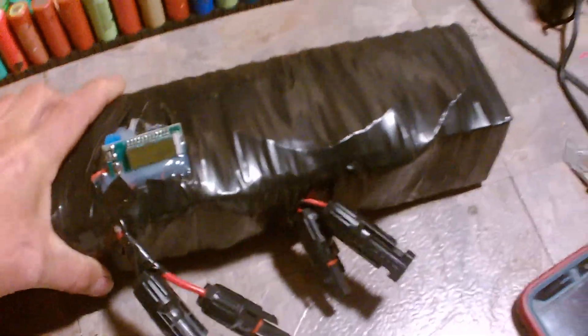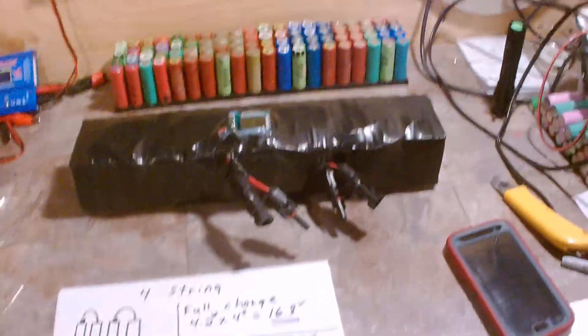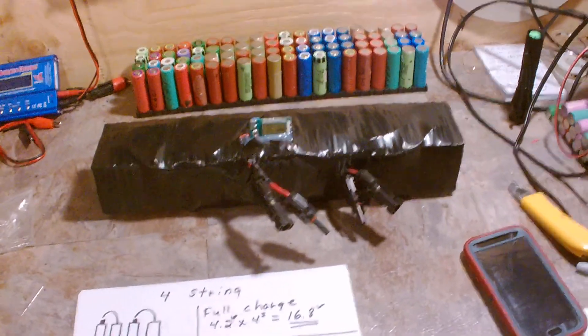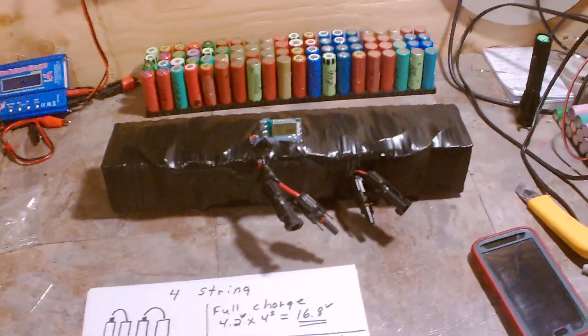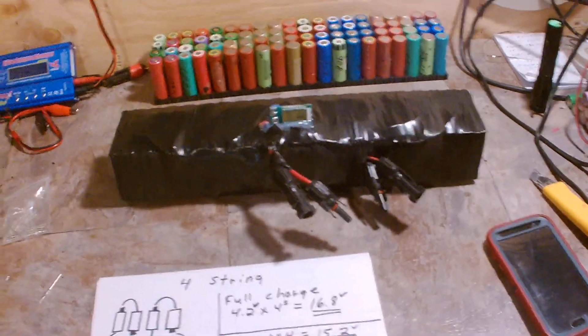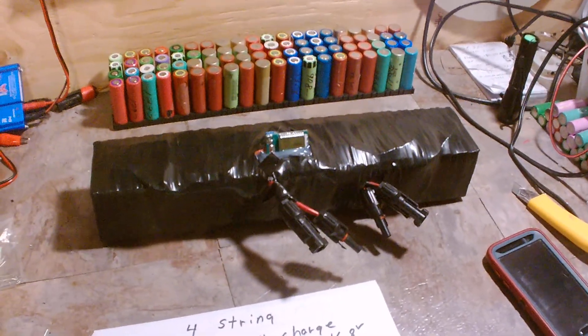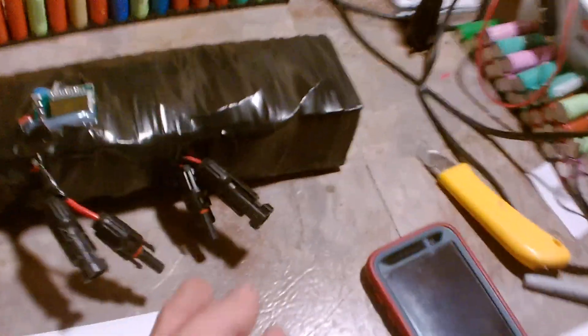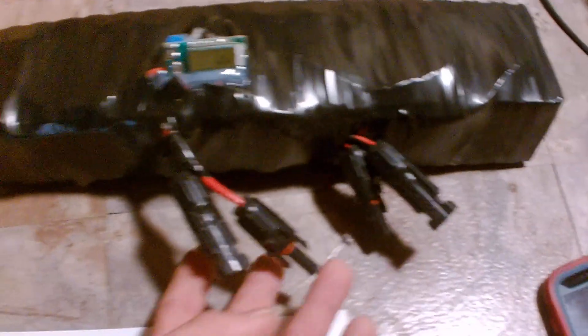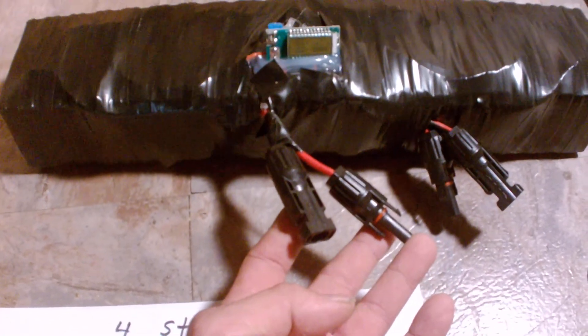There's really nothing to it if you're going into the backwoods. There's very little information out there about it. These batteries, in my opinion, will outperform anything you put against them. Not only that, they're lightweight and you can carry them around. The easy way to eliminate paddling back to shore is to have two of them. Connecting this will work if you have 30 pounds or less. Connecting this will work at all 50 pounds of thrust — that's why there are two different connectors.